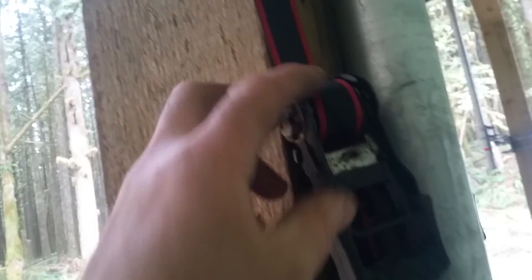In order to install this thing, I'm using a trick — as you can see, I have two ratcheting ropes. It's difficult to do this with one hand, but I lift one, then I have to release because this one gets too thick. This is a way to lift the pipe to the right height without racking my back.